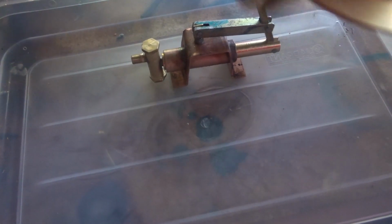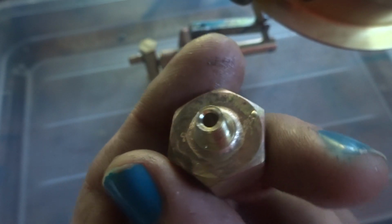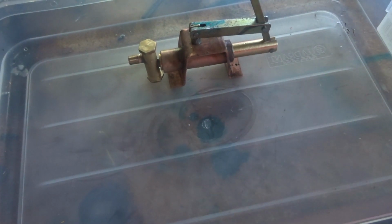And I've been across today and I found a 3/8 BSP cap for this. And I've drilled it and silver soldered a fitting on the end of that. If you have a look, that's 45% silver, a little bit that I had. And you see the nice shiny joint. And we talked about that in the last video. So that's probably overkill, but it's a good accurate gauge. And that's just going to work laying down, and we connect a T through here onto the pump and onto the boiler. So that's the test equipment and test rig.